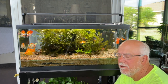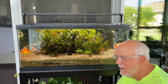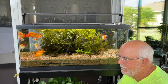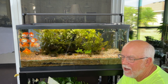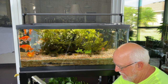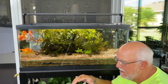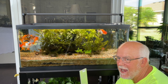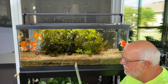And materials, you probably have maybe $20 or less in materials for the tape and for the bar stock here. As long as you have the hacksaw and things like that, usually people have sandpaper already. You've got less than 20 bucks of materials and an hour and a half worth of work. Like I said, the biggest part of this whole thing was that I used the squared off ends, and the biggest thing was putting the two pieces together and filing the two pieces square, so they were the exact same size. Otherwise, the rest of the stuff that I showed you is all a piece of cake. Nothing even to get a sweat over.